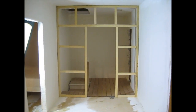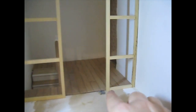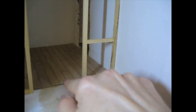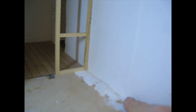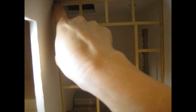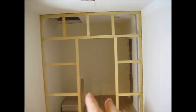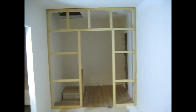The frame for the stud wall is in place and that's a really lovely fit. The bottom is wedged up against the edge of that wooden flooring strip there, so I knew that was in the right place. I measured along here and then made that same measurement along the top at each side. I've actually drawn a line on this side around the frame, so that when I take this out to finish off that back landing, I then know where this will sit. I'm quite pleased with that.